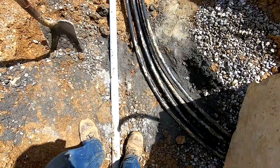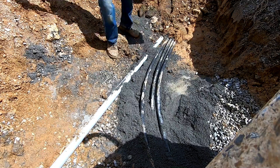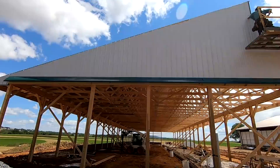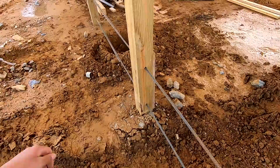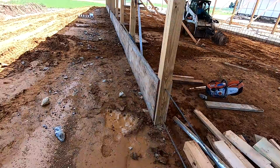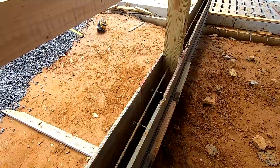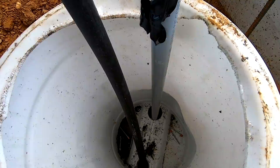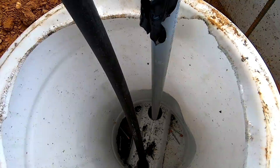We're completely done filling in the middle — those waterers are ready to go. Now we're just working outside. We've got these lines run underneath this concrete block, finishing up this end of the barn. We're working on forming up the curves along the back now. This rebar stuck through the post is going to tie everything together. There are pipes that are going to hang the gates on — they're digging down a little bit to set those pipes deeper. The water troughs will sit right on top of this. We've got the conduit line for the water heater to keep the water from freezing. Got everything filled in and ready to go.